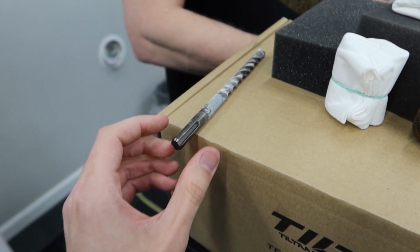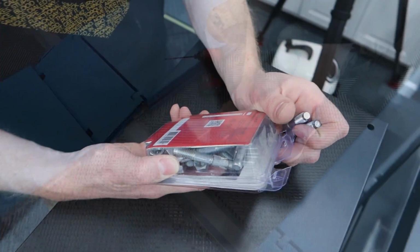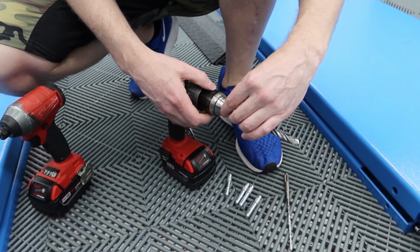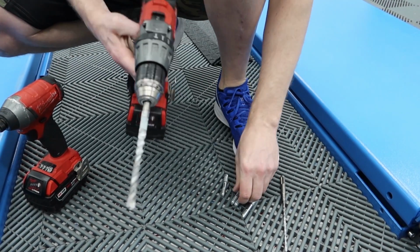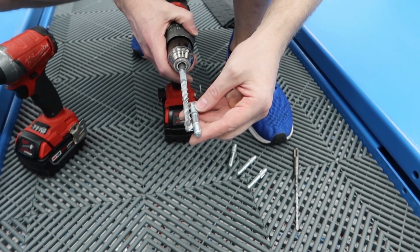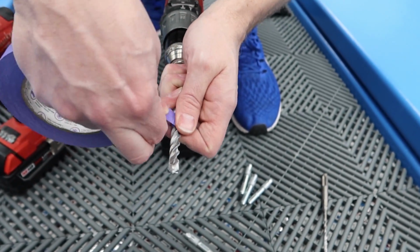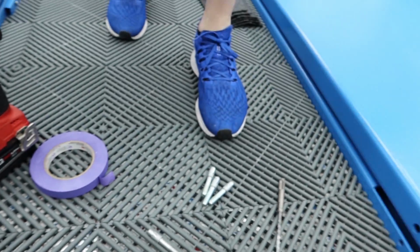So you need a 3/8 inch bit. I don't really like to do pilot holes on concrete to go. I'm afraid this is gonna jump around. We need these to be pretty exact. So if I want this, I have to tape this. So that'll set my depth ish.